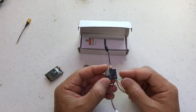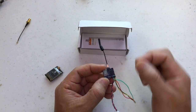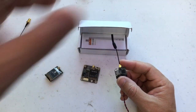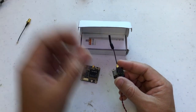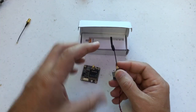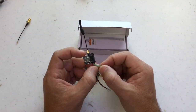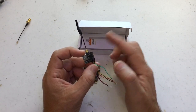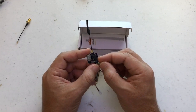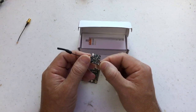Smart audio allows you to do several functions through the flight controller. For example, you can set your VTX so that when you plug in, it starts at 25 milliwatts, and when you arm the quad you can switch to 200 milliwatts. That's good because normally when you arm your quad you are closer to other pilots, and it's not ideal to run 200 milliwatts very close to them when frequencies are close to each other. Using smart audio, every time you plug the battery the flight controller sends the parameters to the VTX, so there is no memory issue — but anyway this unit holds the memory and all the settings. Let's see how it flies.